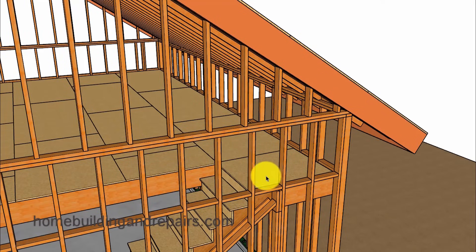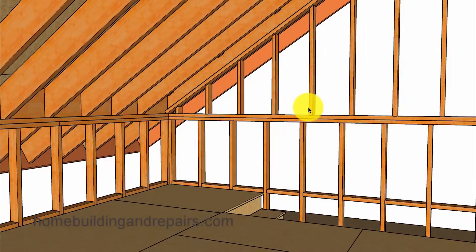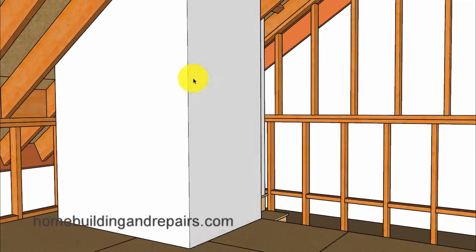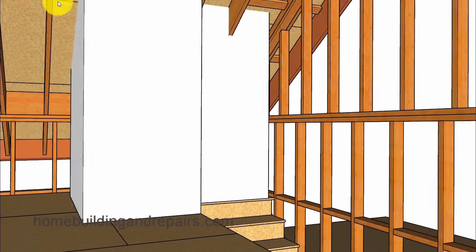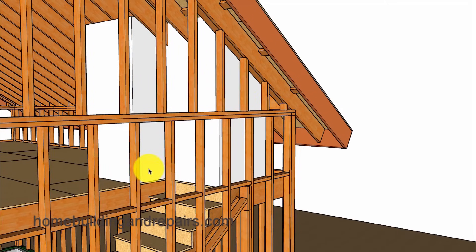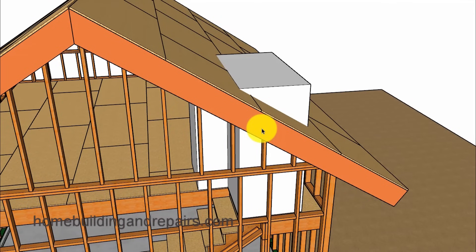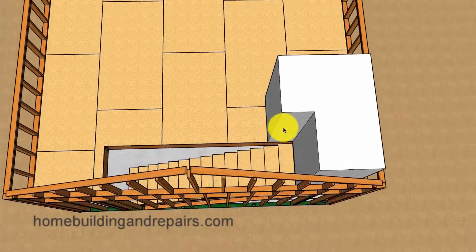Now for the grand finale — the biggest problem I have seen people run into while doing projects like this is usually a headroom problem. In this example, we have about six feet of headroom, and that's not going to be enough according to most building codes. I took an area representing the width, length, and height of the room necessary to make this more acceptable to your local building department. I will explain how to fix this and provide a couple of design ideas to solve this problem in our next video.